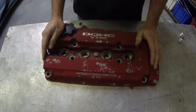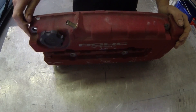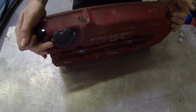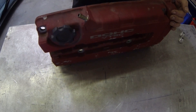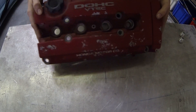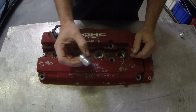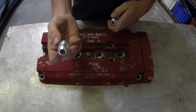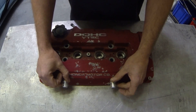After verifying this is made out of aluminum, let's take a look at the factory port. This is great for standard size — usually 3/8 inch or 10 millimeters. The inside diameter is just over a quarter of an inch; that's the maximum flow capability it has. So we're going to say that's not enough for this application and add a dash-10 AN weld port, which has an inside diameter of almost half an inch. We're not going to add one — we're going to add two, effectively quadrupling the flow capability this valve cover is capable of.